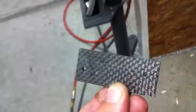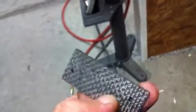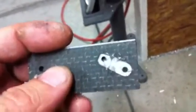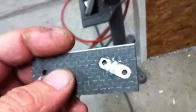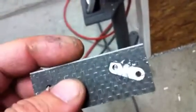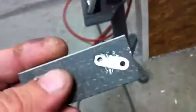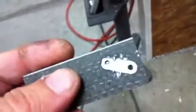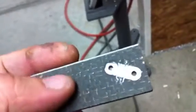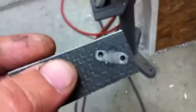It's hard to avoid reflections on this lightning strike carbon fiber. You can also see the reasoning for my titanium inlay — I'm afraid of the knife, in use, beating up the stop pin and elongating the hole if the stop pin was just pressed into the carbon fiber. So I came up with this titanium inlay so that it's pressing against metal and distributing all the pressure through that metal and the epoxy, spreading it out so I'm not beating up the laminate.